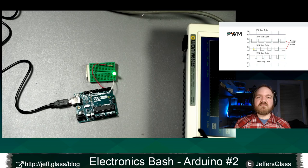The advantage of using an oscilloscope rather than trying to do this by hand, kind of like we did last time with a multimeter, which is only going to update 2, maybe 3 times a second, is that an oscilloscope is going to redraw that display for you thousands or millions, or for the expensive ones, billions of times a second. And so it's going to make a graph for us of what's happening with the pins that we are hooked into on our circuit board here.